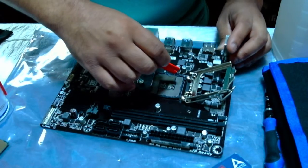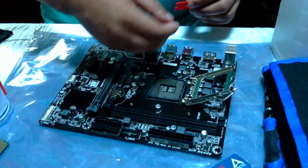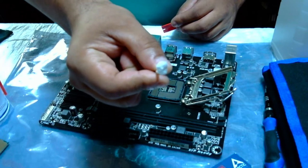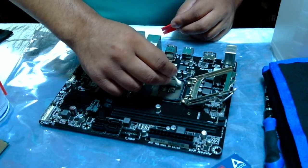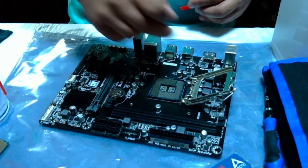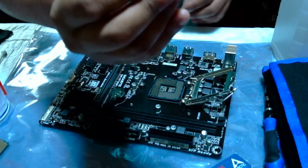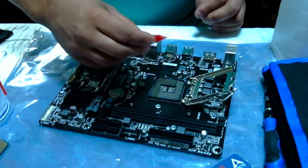What works for me — I had something happen where one of the pins came up because I passed a Q-tip real quick in there. You don't want to do that because the pins get caught within the Q-tip and you can lift up the pin, just like it happened to me. I had to take this little fiberglass razor and lay the pin back down.